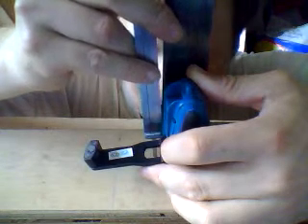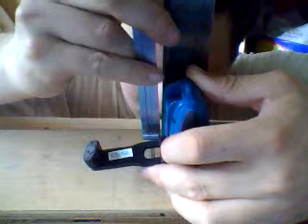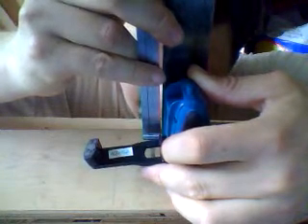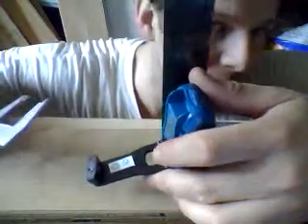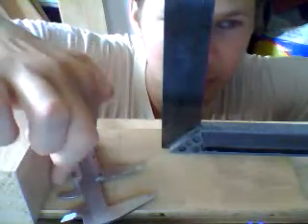Well, this is not a very exact method, but more than enough for what we want to achieve. We got it, and it says 28 — 28 millimeters, roughly. Approximately 28. So we will have to make our hole at 28 millimeters of height from the bottom.